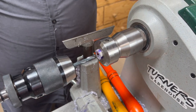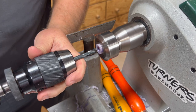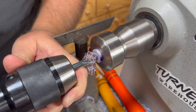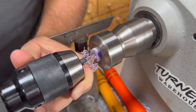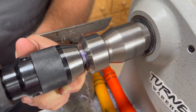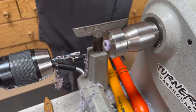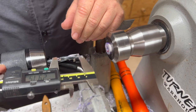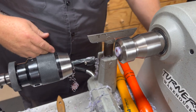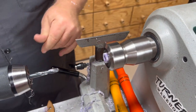Always unlock your machine. We can give it just a little squirt of lubricant. Remember, we have a 6mm pilot hole already, so it's not going to be taking out all the material — it's really just taking off a skim, since that 6mm is not much smaller than this 9/32nd. I think I made it all the way through. If I'm not sure, I can measure to make sure it's 30 millimeters. Yes, it certainly is — so as long as I cleared that, I should be in good shape. This is our through hole and we are all the way through.